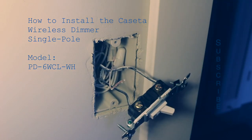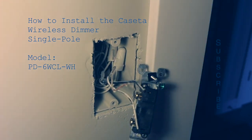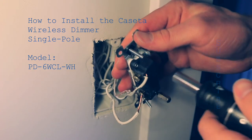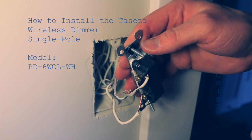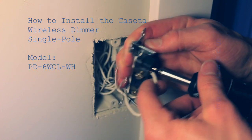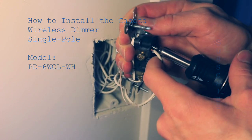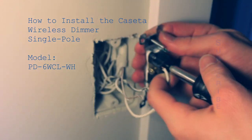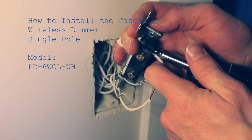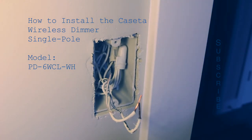In a single pole switch, meaning you only have one switch going to one light circuit, you don't need to differentiate the other two wires — simply remove them from the switch. If you have these newer switches in your house, use a small flathead screwdriver and insert it all the way in and the wires come out easily. My screwdriver was a little too big, so I had to work it a bit. In future ones I used a smaller screwdriver to get it in further, making it much easier. If the wire is screwed in, just straighten it out like you did the ground wire.